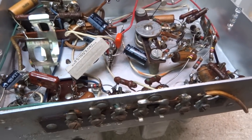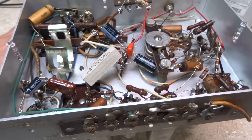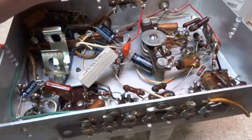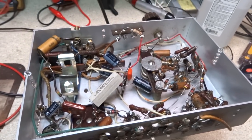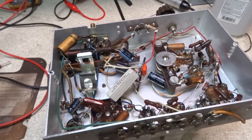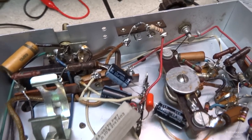I hooked this up and it does work, although it's not quite as sensitive as I'd like it to be. I think I need to get this dropping resistor taken care of — I'm trying to find the right one. I used an NTE 125 diode, a multi-purpose rectifier diode up to 1,000 volts and 2 amps. Just need to find the right dropping resistor to get it down to about 125 volts.